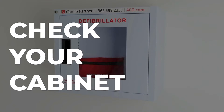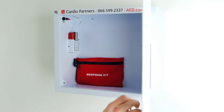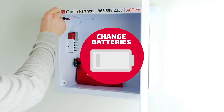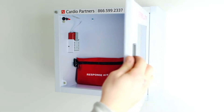Step 5: check the integrity and security of your AED cabinet. If your cabinet has an alarm, this is a good time to trigger it and ensure it sounds. If it does not sound, it might be time to change the batteries — you can find the right batteries to use and the replacement instructions in your cabinet manual. Lastly, check that the door can easily open and isn't obstructed by nearby doors or other items.